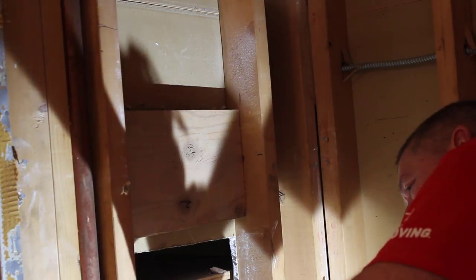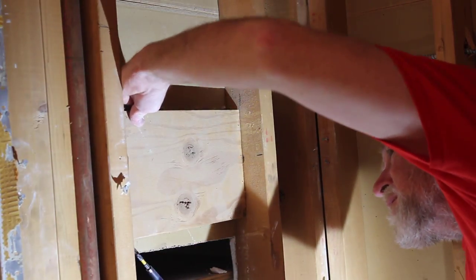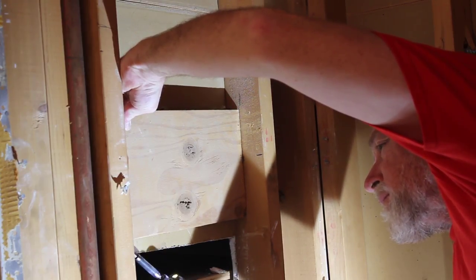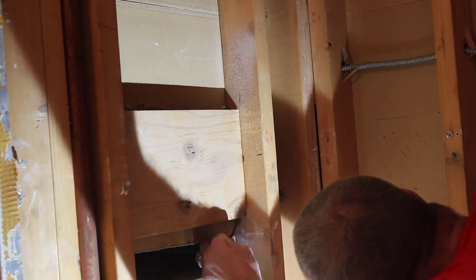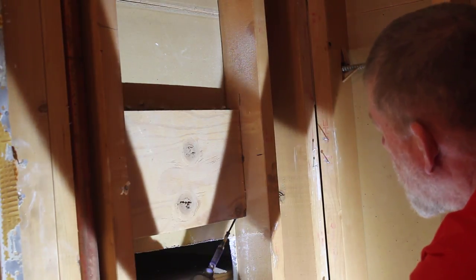Working on the plumbing is the first step when it comes to rebuilding the shower. We'll need to add a backer board that will support the valve assembly. Look at the directions on the fixtures that you purchased to see how far back that backer board needs to be.